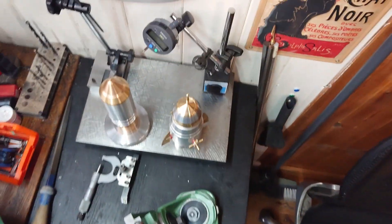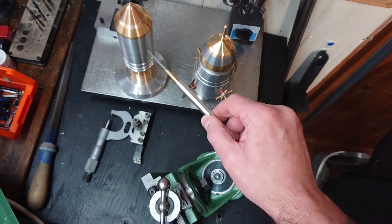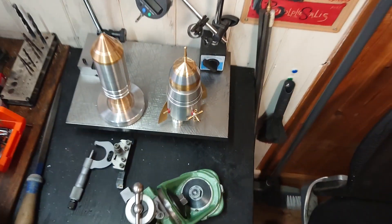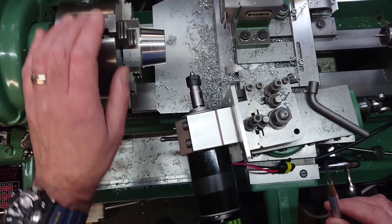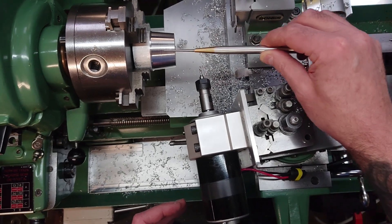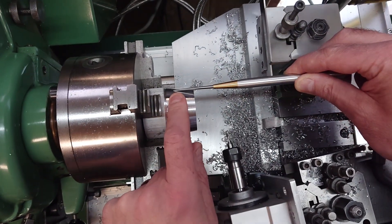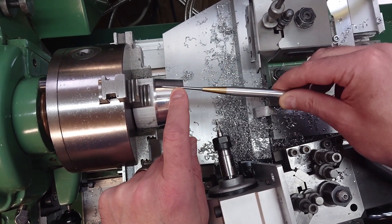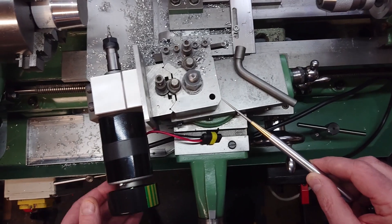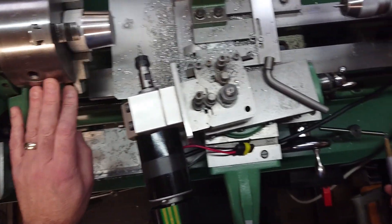I've been making a few of these rocket type things for a little while and they're coming along great, but they need a bit more detail like windows, holes and things like that placed around the circumference, especially on the angles, which I think will look quite nice. I was wondering how I could do that and get the cut to go in the correct orientation — instead of being straight, if a cut was on that angle you'd get it thick inside and tapered, thinner at this end. What I wanted was to get it even across, and the only way I could think of was making this attachment to fit on the Dixon's tool holder. I'm only making small items in soft material — aluminium, brass and things like that — so I thought I'd give it a whirl and see how we go.